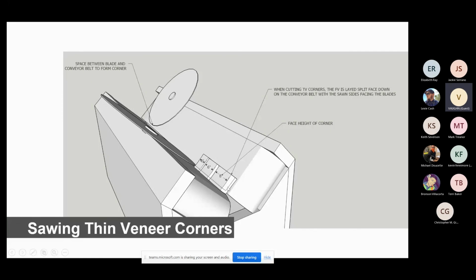Now the thing with the corners though, because this runs on a 45-degree, if there's any bulges on both sides of this stone, it could really make that corner whopper jawed. So a lot of tooling needs to take place. And that 45-degree is of utmost importance, because if we try to stack this standing straight up and down, it will wobble as it gets sawn, and it will throw your L in the middle way off to where it'll just run angled through it.